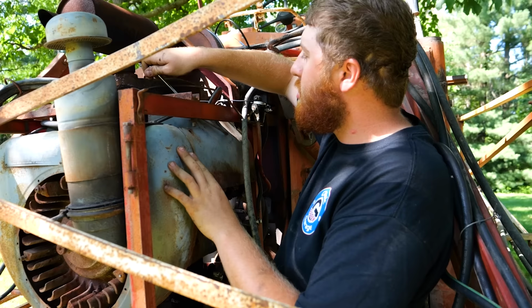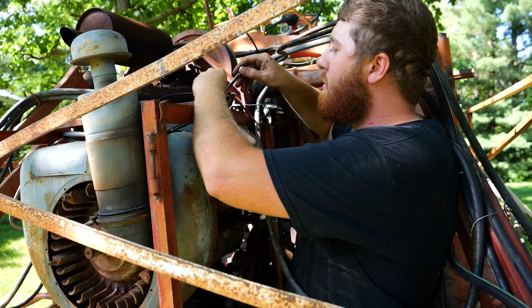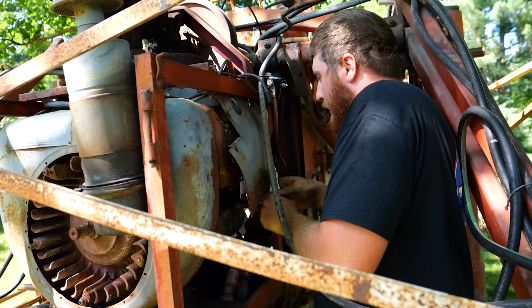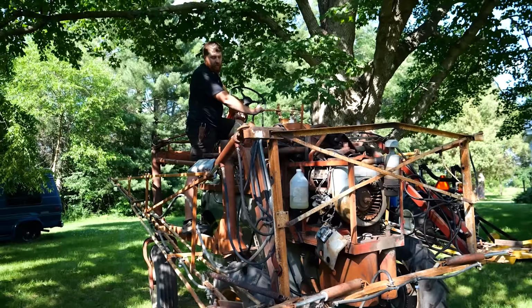So we're going to take these engine shrouds off real quick and get all that mouse crap out of there, and then this thing should finally be able to breathe and pull air through and cool our cylinder heads, and we'll be ready to hit the field after the one other thing, which you'll see here in a second. Oh yeah, no wonder that was getting so warm. I'll keep taking these shrouds off and get all this cleaned out, and then we'll be back. Holy hell. Got all of our poop out. We're going to fire this thing up and let it eviscerate the rest.